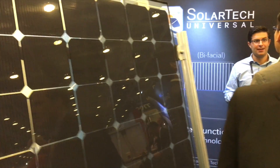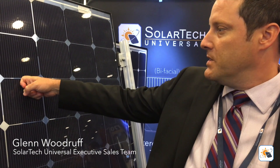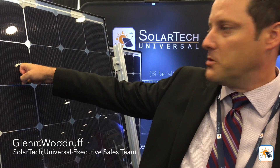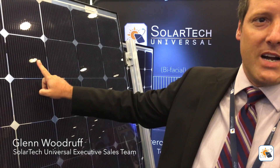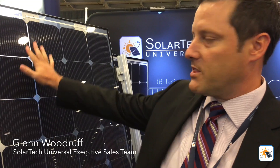With this technology, we're still able to collect that energy. I think you can see the significance of that. Also, electron recombination — these wires act like highways and byways on a road system. In a traditional module with bus bars, you have all these electrons fighting for space on those bus bars. With SmartWire, we're able to get those electrons off of the cells very efficiently.